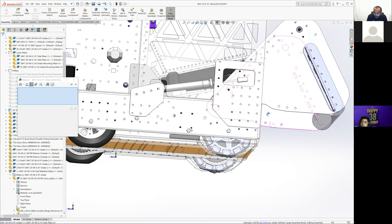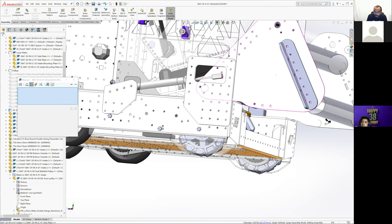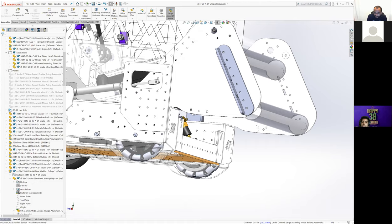So we're pulling it up through, we're compressing the ball pretty heavily through our initial push. But it seemed to not have any issues doing that since you're only compressing it that far through a very small amount of the ball. The ball's able to deform into our bumper over this rail and over the other side of the tube, where only a little bit along the center line of the ball is actually compressed to that number. If we were trying to compress the ball to 4.2 through two flat plates, that's much, much harder and takes a lot more force than doing it through just a center point with rollers, as it's just compressing as it goes through and expanding on the other side.